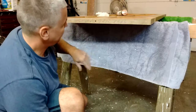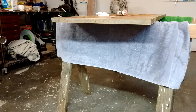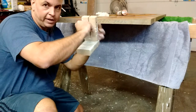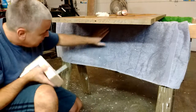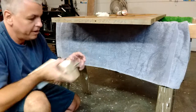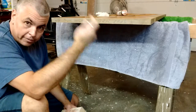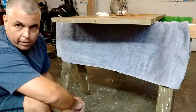Okay. So I got that hole there. And then later, when I'm done prepping the other side of the door, we're going to stick this lag bolt in here with this fixture on it and crank it shut. And you can't see it now, but you'll see it later. The top of my sawhorses have a notch cut for the other bolts. So one bolt is in this side, one in that side, and it becomes the axis of rotation for these doors.